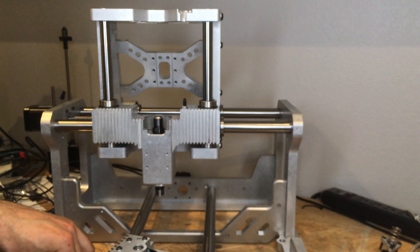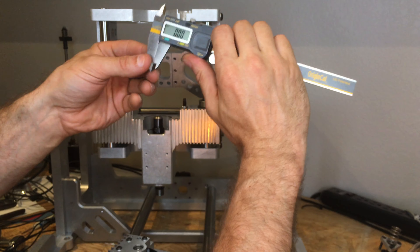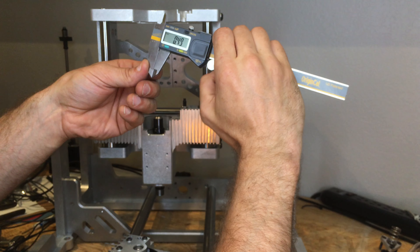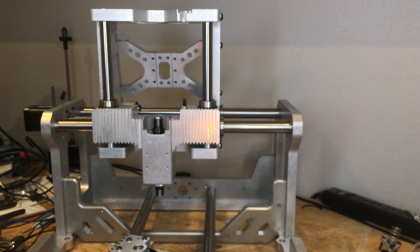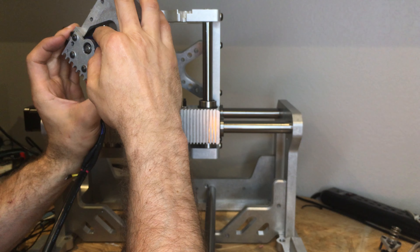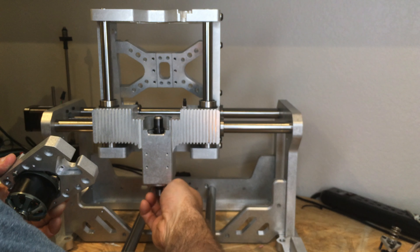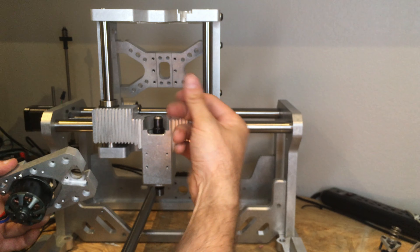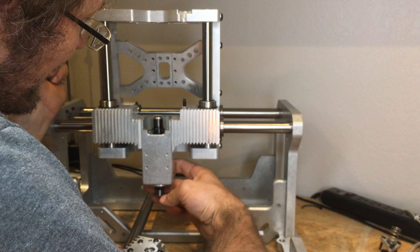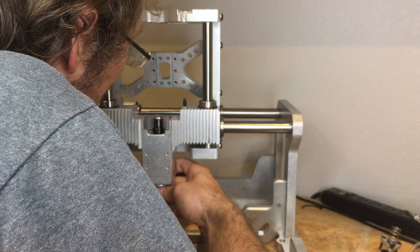I thought we were going to find something cool with this spindle design. We definitely have a belt drive — fighting with incorrect alignment. That belt is not going to last long. Are you serious? That belt is not even three-quarters of a millimeter thick. I don't know the exact thickness but it's definitely not going to last long. Look at that: 0.5mm thick belt.